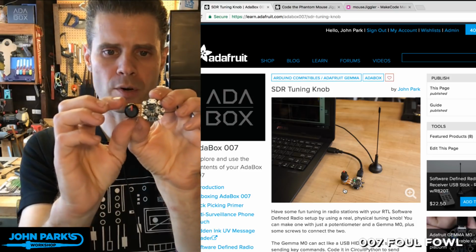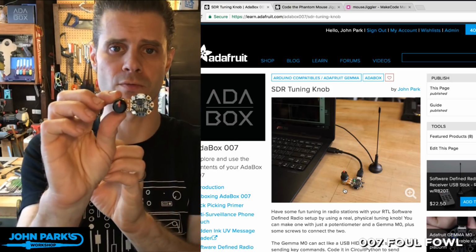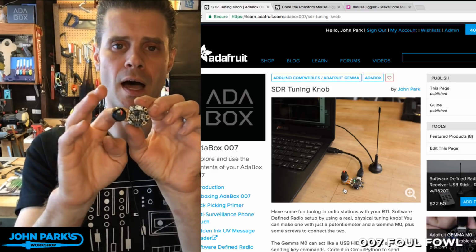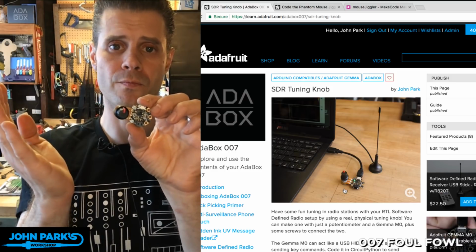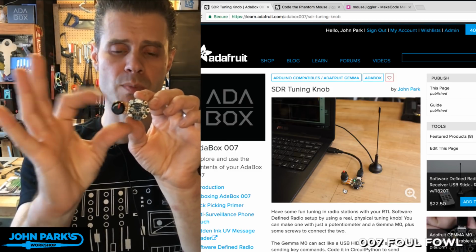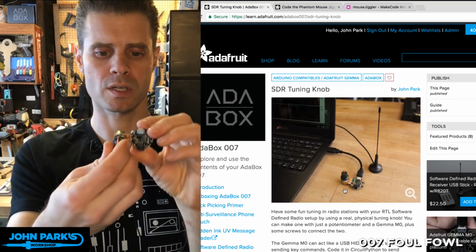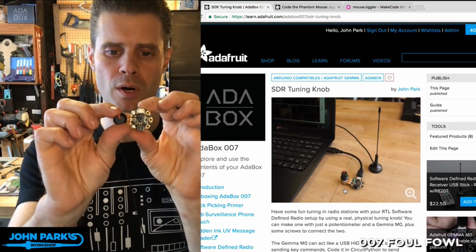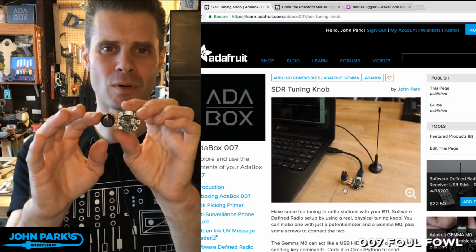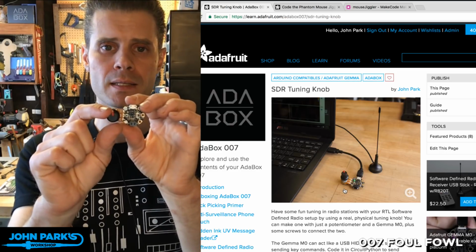And so what I'm doing is I'm actually reading the analog values of the potentiometer. So the way the potentiometer works is that on one leg it's touching ground, on the other it's touching positive voltage, in this case 3.3 volts. And then the middle leg is reporting out signal, which is the voltage that's coming to that pin based on moving the wiper of this variable resistor, this potentiometer. So when it's in its center position, it reports half of 3.3. I can't do that math, but about 1.125 or something. I don't know what that is. Someone do that. At that halfway mark, it doesn't type anything.